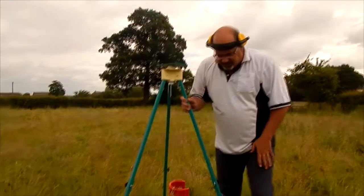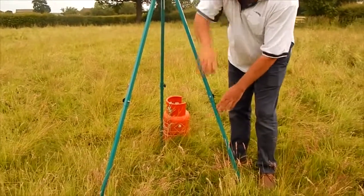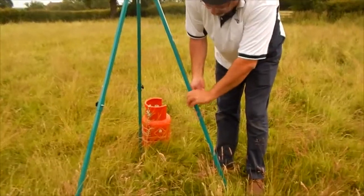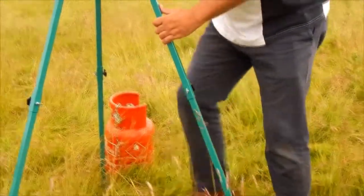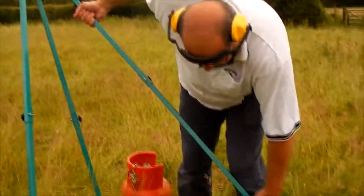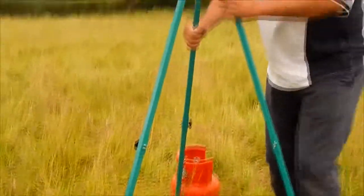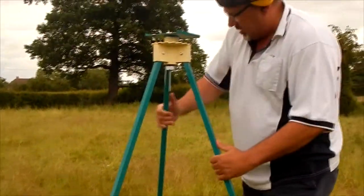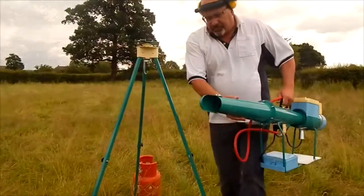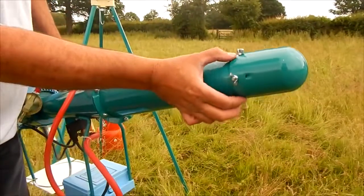The tripod stand is very easy to assemble. Basically it comes with the legs separately from the top mount. These are just fitted with a simple bolt with a wing nut screw system. Always ensure that the angle of the feet are angled internally. This means it will rest securely and flat. You pull the legs out to the maximum width.